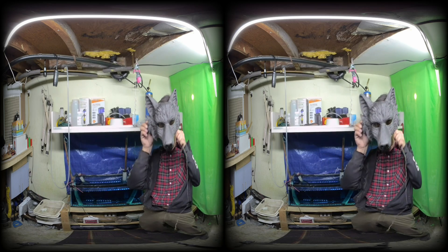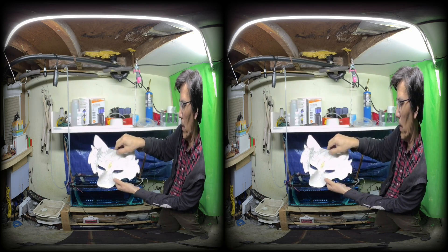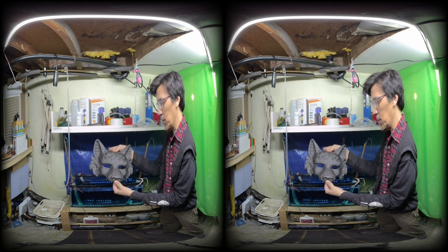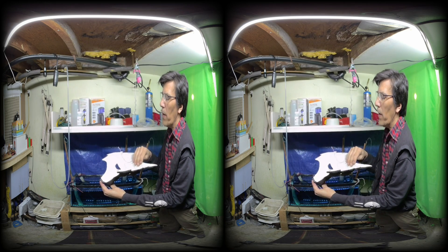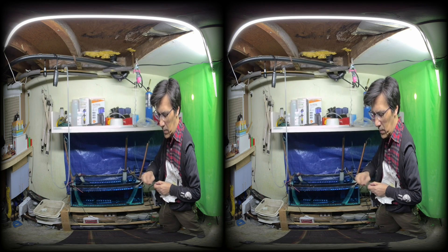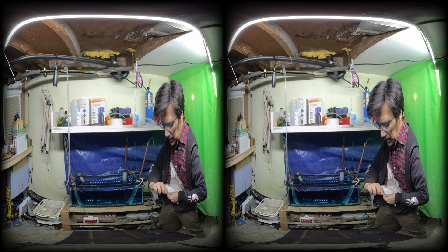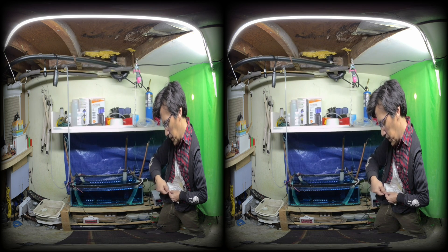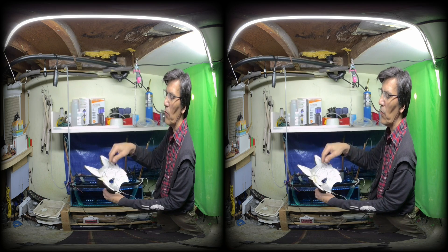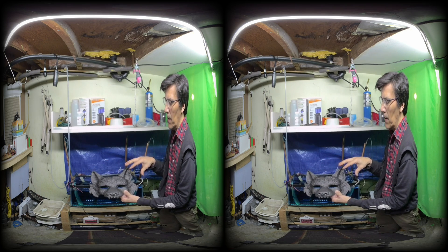This is our wolf mask. Right now it's graphite black. We glued wire around the perimeter and got some other wire in key spots too. It's a large surface area and my 10 amp rectifier might not handle it, so I'll have to jump up to the 25. The wire I'm using is rated for 10 amps, so I'd like to double up on it. I use shielded wire in the tank as much as I can because you can always reuse it. Exposed wire I use primarily in areas you can't see, so the conductive paint has something to grow from — it's really an anchor. You can get the most wire in without disrupting the aesthetic, and it'll plate a lot faster.